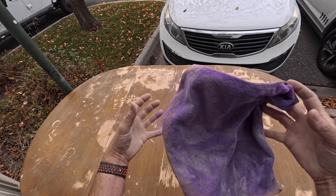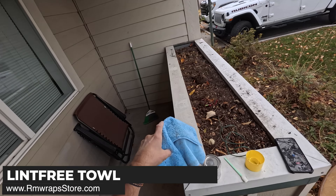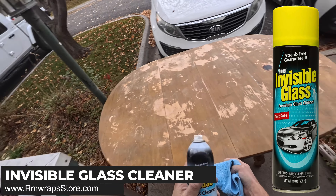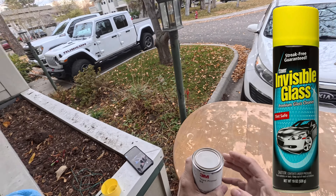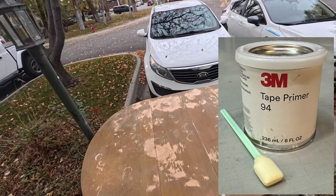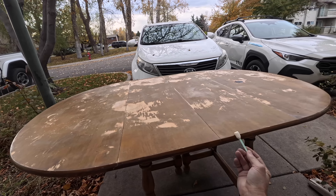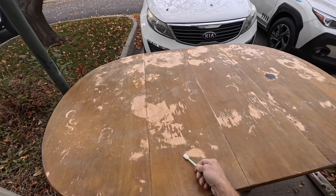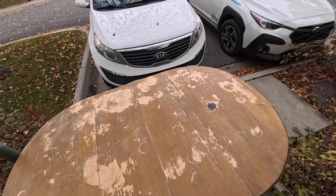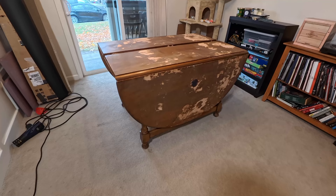After sanding is all done, you take a rag - I actually have two rags. The first rag is to get the dust and big chunks off. The second rag is a terrycloth microfiber towel with invisible glass cleaner, and I cleaned it real good. The last thing I like to do is use Primer 94 around the edges and underneath, where the vinyl actually sticks much better around the edges - a lot less chance of lifting up. If raw wood is not sticking good enough, I use Primer 94 on the raw wood.